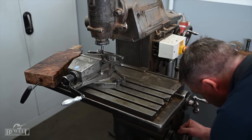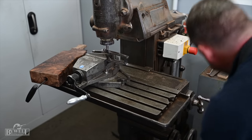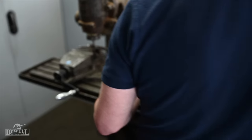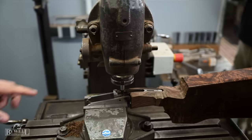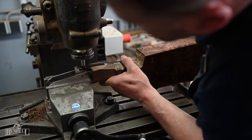The basic box, you know, so this is the milling fixture now to do those two slots. Because it's a custom stock, so it's no CNC work on that one, so you really have to do everything manually. So what he's doing here on the manual milling machine is normally done on the pre-cut stock on the CNC machine.